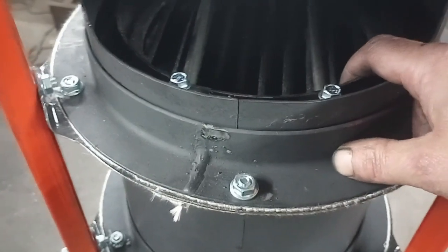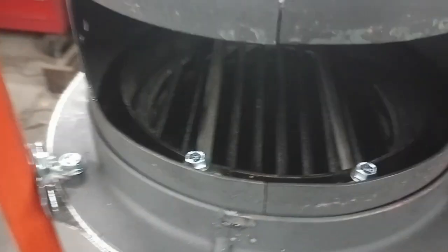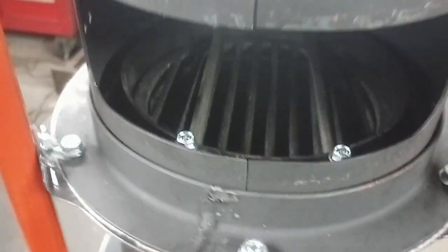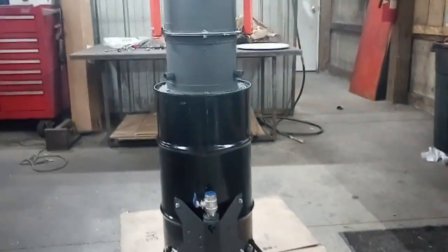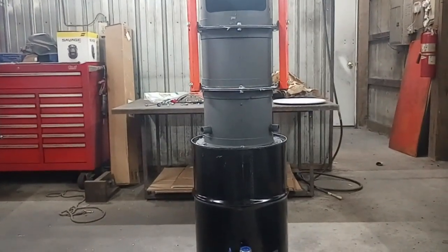So if you need to service this, you loosen these set screws up, and then inside of here, you'll knock the pins back, and then you can drop the grate completely out of this unit, and then basically reinstall and re-secure the pins. And that's what makes this machine capable of running charcoal, is the ease of access to the reduction servicing. And that's pretty much a requirement, because charcoal does make clinkers, and you need a way to get them out.